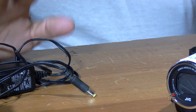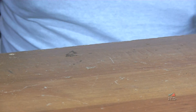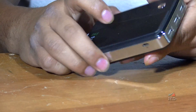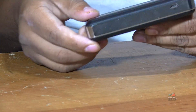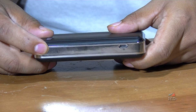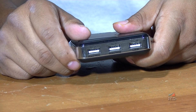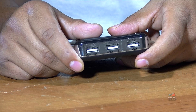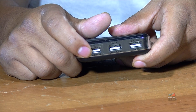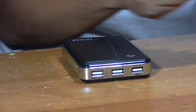So I decided to try something — I don't know if it's going to work. For cell phones, we have something like this, which I also got on Black Friday for a special price. It charges through USB. Here it is — it charges from there. It's a USB power bank: here, 5 volts at 2.4 amps, and the other two ports are 5 volts at 1 amp. So these seem really similar to what we would get out of the camera's charger.